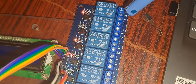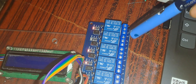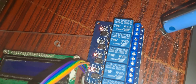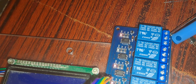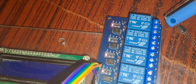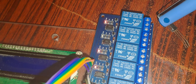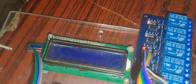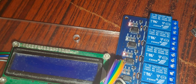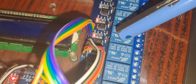Based on the required circuit diagram we have to connect our load on the appropriate side. This is the mains line connection, so we need to be very careful while working on this side. Below this part there will be live conductors — mains conductors at 220 volts. We need to be very careful on this section. The other sections of the board work on normal plus 5 volts DC supply.